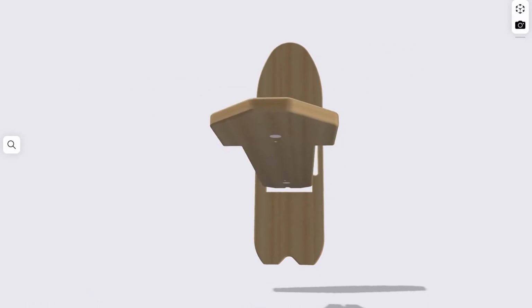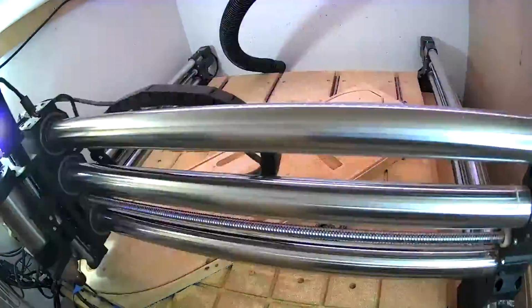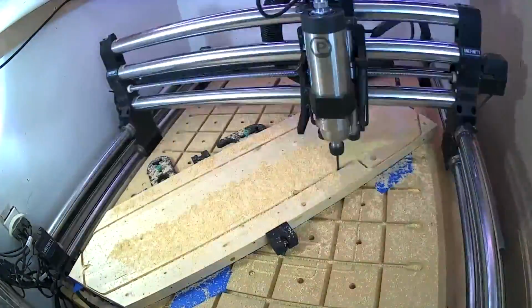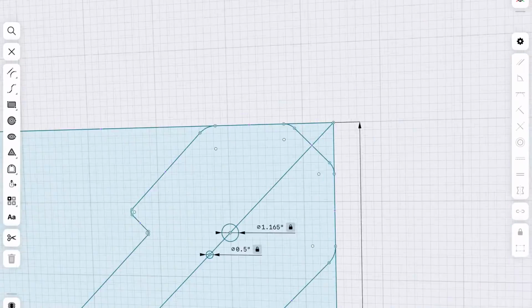These chairs are in two parts. Both of them are 42 inches long, and they were both cut on my 32 by 32 Elite Woodworker. So in this episode, we're going to cover how to toolpath, position material, and cut parts diagonally so you can exceed the standard X and Y axis limitations of your machine. Pretty cool. So let's get into it.